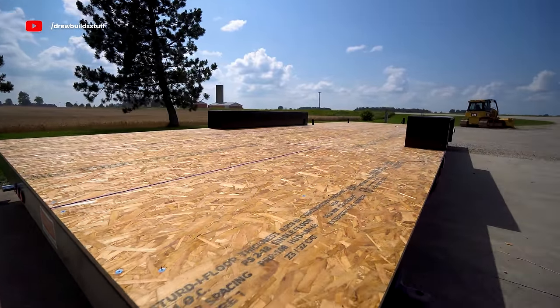And then I'd go ahead and mark out all the stud placement according to the blueprint. I'd basically mark out all the jack and king studs for doors and windows, and then all the middle studs I'd just do 16 inches on center, starting from one end of the wall. With all the studs marked onto one board, I'd just use a square to quickly transfer that over to the other plate. And then in every wall, I have a bunch of these studs that are all the same length, so I went ahead and cut out a bunch of those. In this case, it's 7'3.5".